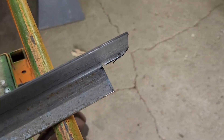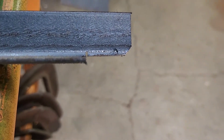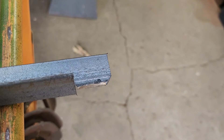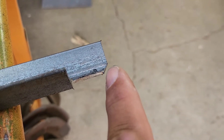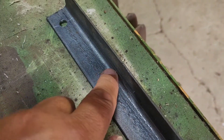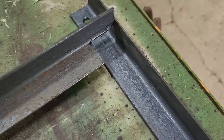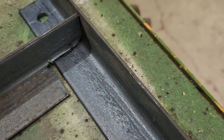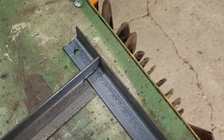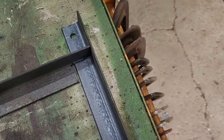This is what your cut is going to look like. You can see we cut a thickness of material out too. The other thing you want to do is nip this corner off right here. The reason we've got to nip that little corner off is because the inside corner of your angle iron is rounded — if we left that square, it wouldn't butt up completely. You can see now it goes all the way into that corner, and that's what it looks like: nice and tight, very easy to weld up. We've just got three more of those to cut.